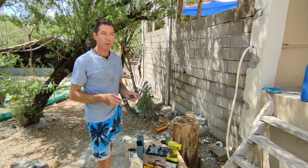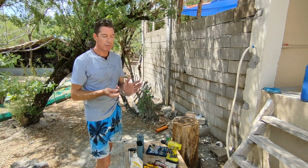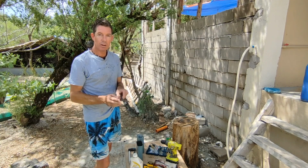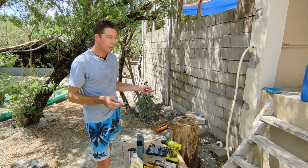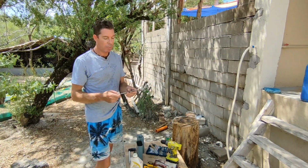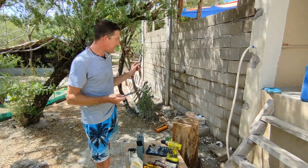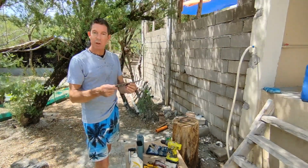So we'll then temper it in the oven, and that'll be 3 cycles, 2 hours per cycle. I'll clamp it in angle iron so that it can't bend or twist, and if we do pick up any warps or twists or bends in this heat treatment process, that should take care of that in the oven. So I need to fire up the forge again and heat treat this beautiful looking knife.